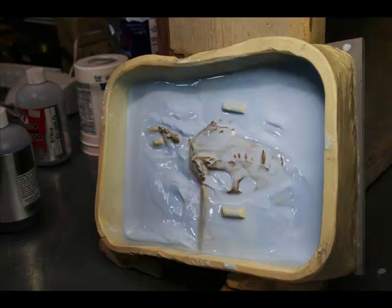Especially on delicate specimens like this, I let the rubber set up under pressure — the same pressure I'll use later when filling that mold with resin. That way, if there are some voids in the rubber you didn't see or take care of, they will maintain the same volume as in the mold.